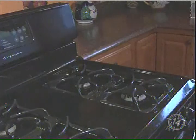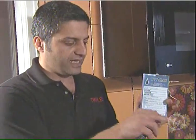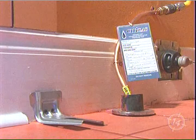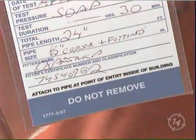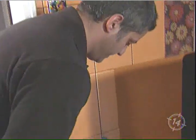Now, unfortunately, not all gas hookups are created equal. Number one is the tag. If it's not tagged, it's illegal, period. Anybody that works on your home, whether they're installing a gas line for a stove, a fireplace, a furnace, doesn't matter what it is, if they're tampering with it or doing a new installation, it's not legal if it's not tagged. Now, if you follow me down, I'll show you what I mean.